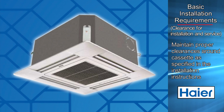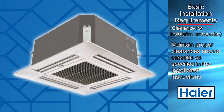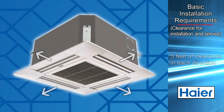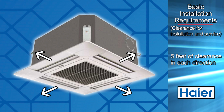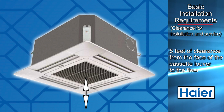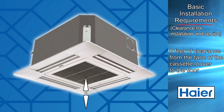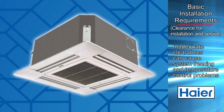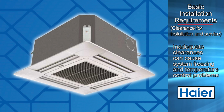Make certain to maintain proper clearances around the cassette as specified in the installation instructions. Standard clearances for cassette air handlers require 5 feet of clearance in each direction. There should also be 8 feet of clearance from the face of the cassette louver to the floor. Inadequate clearances can cause system freezing and temperature control problems.